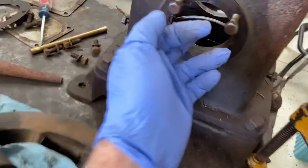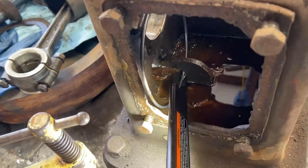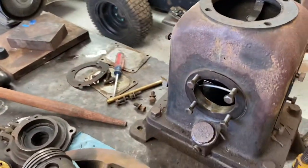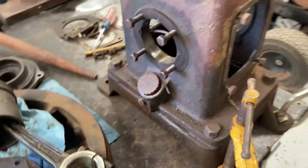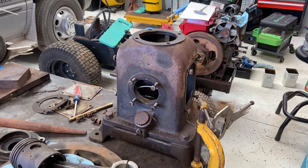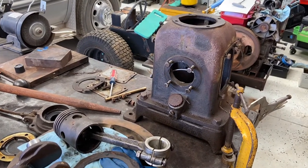Grab the light — see this ring right here? It rides on the crankshaft. I wasn't sure what that was for, and you can see it's retained by that cast iron hook shape in the bottom. I was asking my buddy Jim about it — that's the oil slinger. I've never seen a slinger like that before; usually you see something attached to the bottom bearing cap for slinging oil, not on this design. Also, this compressor doesn't have a valve that controls pressure relief — it's done by RPM. That setup attached to the flywheel will be featured in a later video.